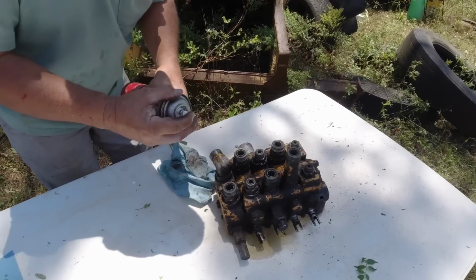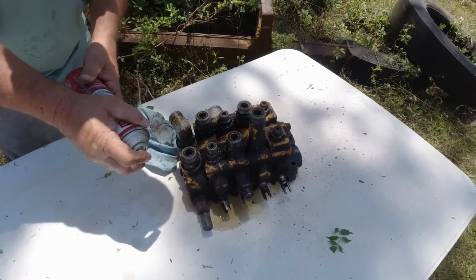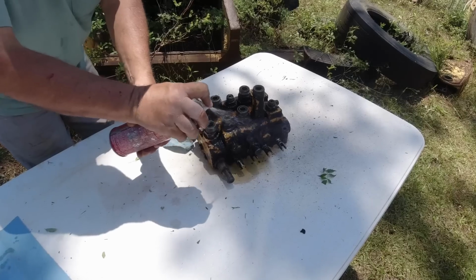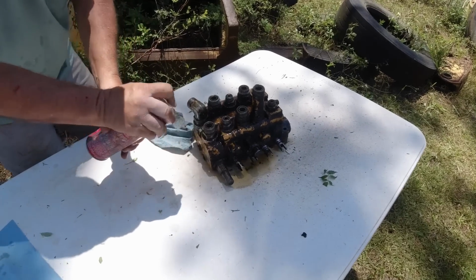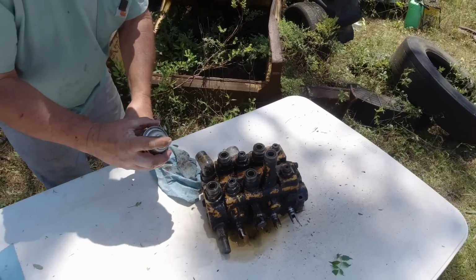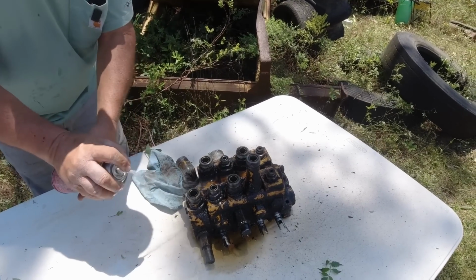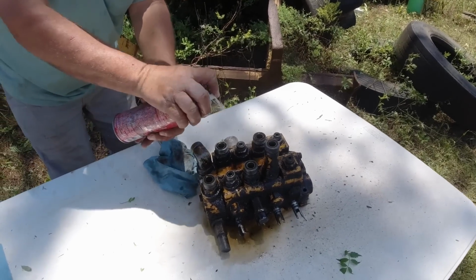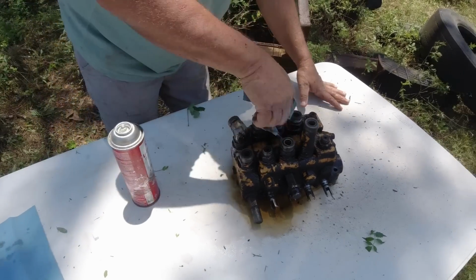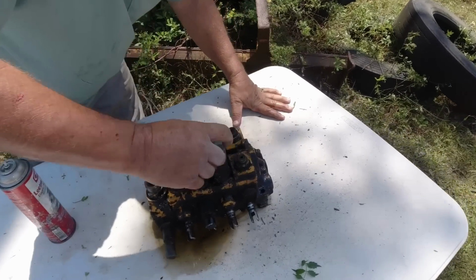Good news is if we can just get it where it's not pouring out. Right. We can get the grapple up, because the blade has a separate valve bank. Gotcha. And the transmission builds up pressure through the hydraulic pump. Okay. All this does is function the grapple. Yeah, that does make it easier.